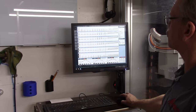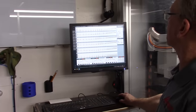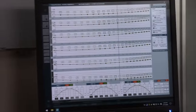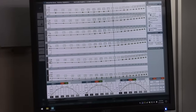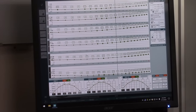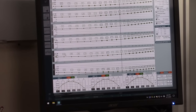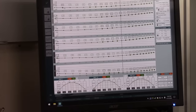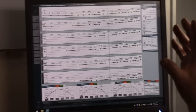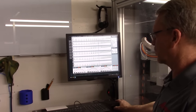And these are each string individually. So now we have it right on the line that we wanted it to be, with the exception of, I mean, we've got a few here, 2/6000ths of a millimeter off, but all within the acceptability range. It's crazy how little it is, but you can see each string individually, it's right on the money for what we need for best playability of the action that was determined by what you like to send your guitars out as.